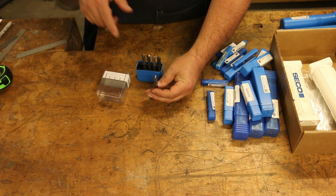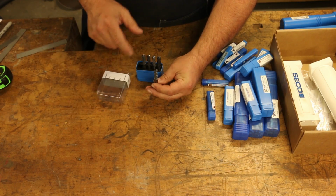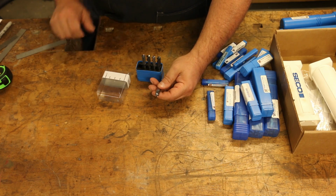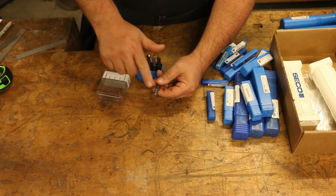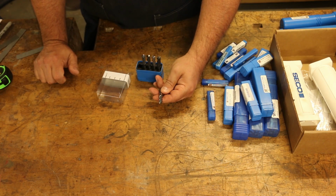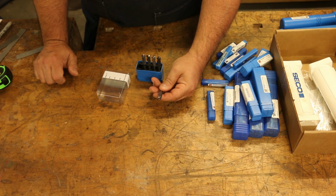So the interesting thing about this is, even though it's a 4 flute, the angles between these flutes are different. It's not like 90 degrees apart. And that right there actually changes the harmonics as it's cutting. So instead of one cut every, in an even time per revolution, it's kind of irregular, and that helps fight the harmonics. And another thing that it has is that the actual grind angle on each one of these spirals is also just a little bit different. They'll all remove metal, but because they're all different, it's taking a different cut at different intervals on every revolution.